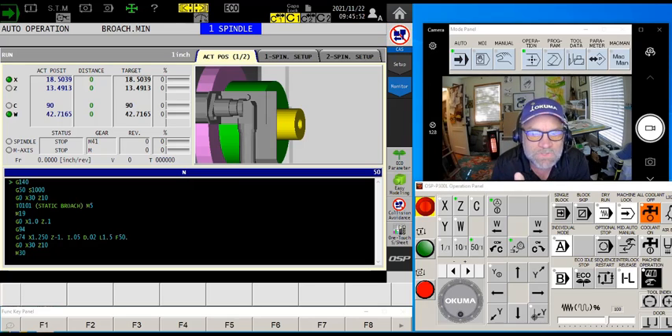Let's start by talking about the way we're going to hold a broach. If you have a rotary broach and you're doing an entire ID, go for it — those things are awesome. You can simply position it, do all the preamble stuff the manufacturer recommends: slight taper on the beginning of the hole, come in at an aggressive feed rate so the rotary broach won't double-clutch, then feed forward and allow the wobbling of the bearing to do its thing.